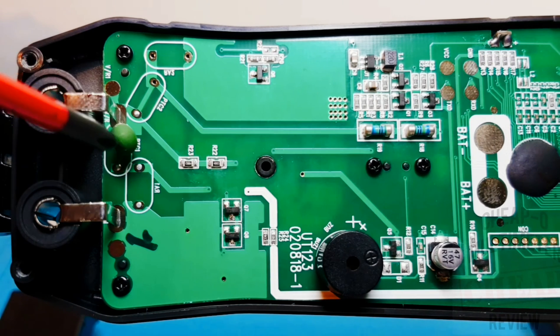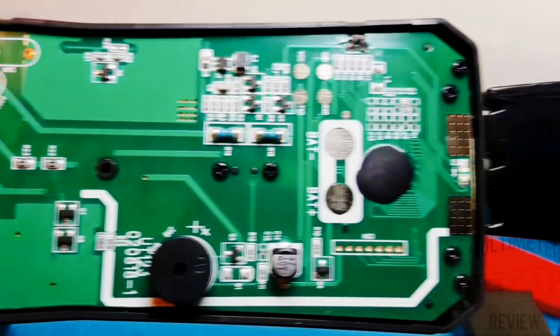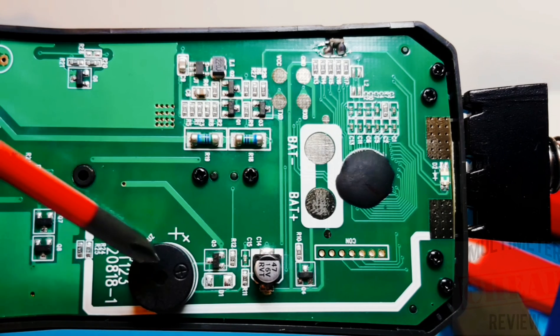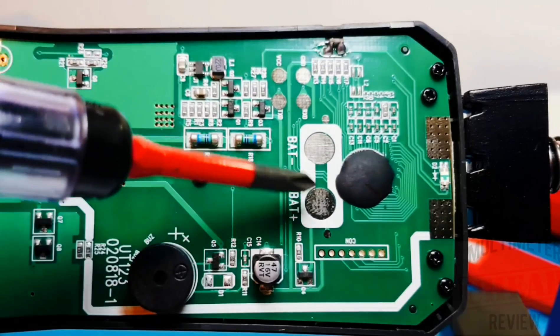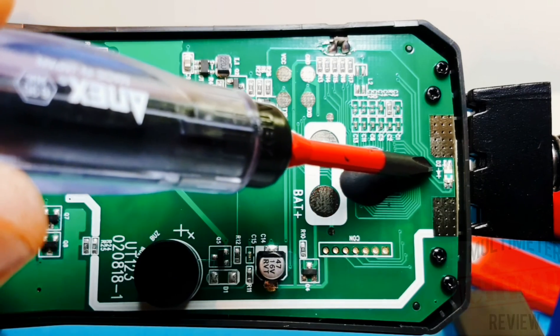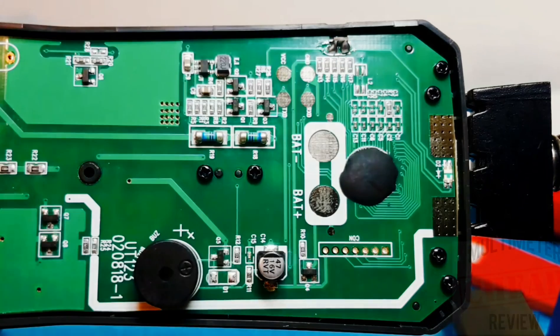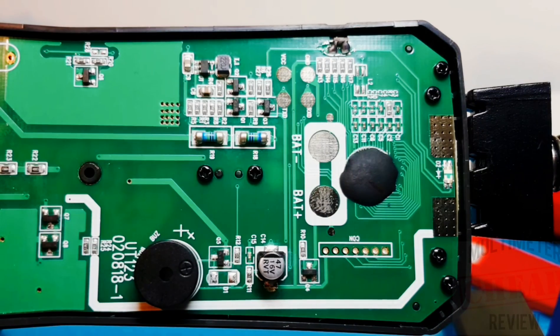Moving down the line, there's one PTC for the voltage side of things and a transistor clamp. There's a nice big piezo speaker, though surprisingly it was a little low in sound output despite the size of that piezo. The fab date is August 2018, revision one - brand new meter. In the middle of the board for NCV detection there's a diode, and that is what gives us that really nice visual continuity and NCV indicator.